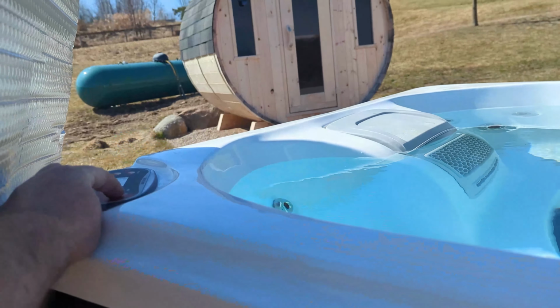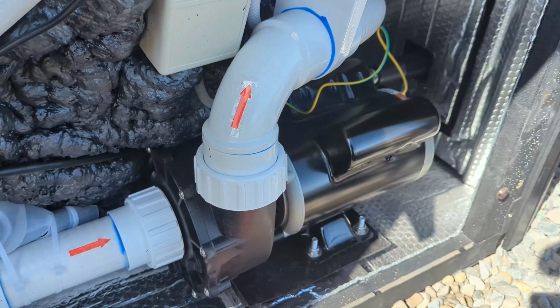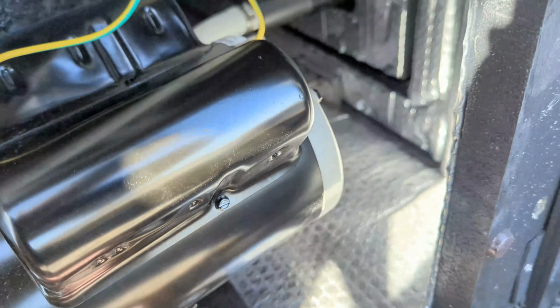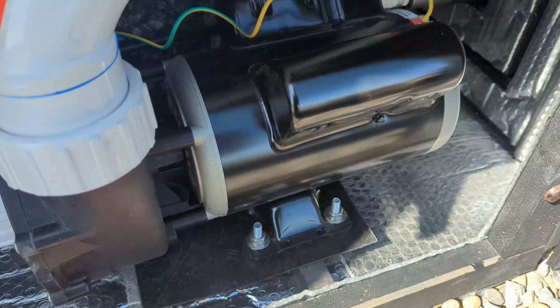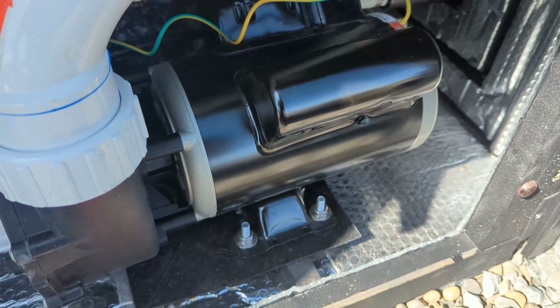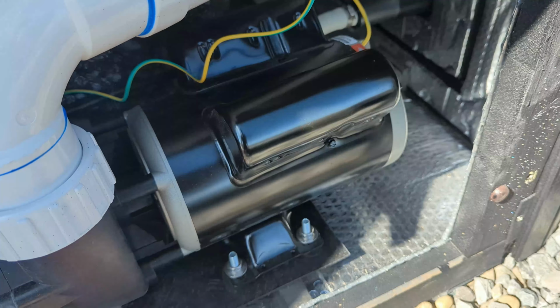It's just sitting there. So we'll turn it on. Oh, it spun. It spun on its own. It might have been just stuck. But normally, if your pump is humming, twist the shaft, and if it twists freely, then you have to change one of these capacitors, and you're going to test those.